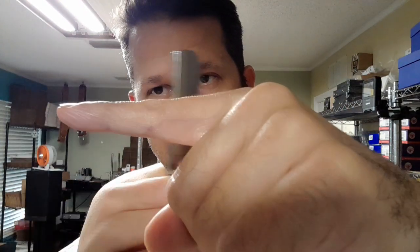I did the thing that I don't do in videos for customers, where I angled off-axis with the knife, because it does make funny marks. You're basically changing the diameter of your stone on the fly. When the stone has a primary diameter one way and a secondary diameter the other way, if you go like this on the stone you're interacting squarely with the long-axis diameter; if you go the other way you're interacting squarely with the short-axis diameter. If you go at an angle you're misaligning the contact points of the spine and the edge.